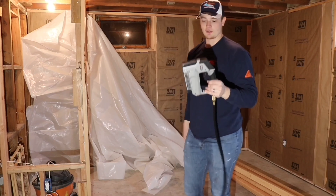If you guys are doing this alone and you don't have anyone to help you hold the plastic up, you can give yourself just a little bit of slack and then just staple a couple times up here in the joists — wherever you're not going to have to worry about a bunch of staples you'll need to take back out. So I'm just going to pull it up here and then shoot a few staples to hold it, that way it will hold it up there while you work with the bottom section.